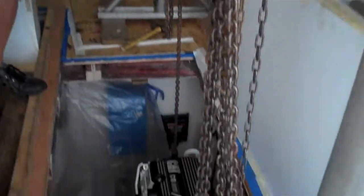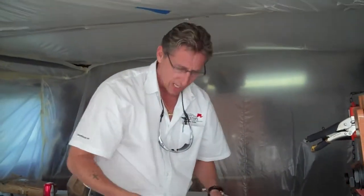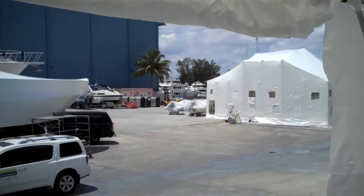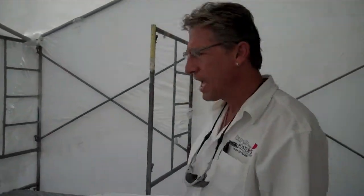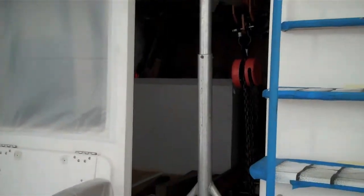The new engine, when it goes back in, has to look just like this — it's got to be de-dressed, disassembled, everything taken off so that it can fit in the space and then built back out. If you also follow me here, you can see we've cut the tent back there, so we get the forklift back in here with the long extension boom and get it right through that hole to lift up the engine and pull it straight out.